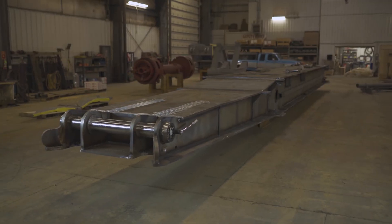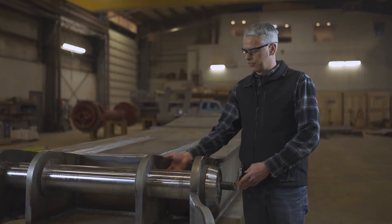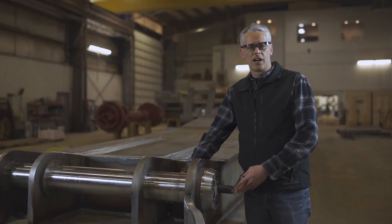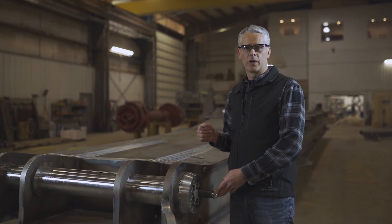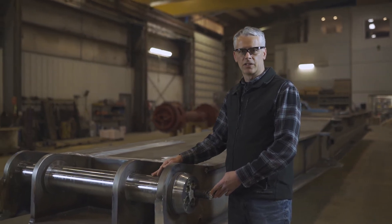When picking up the low boy or lowering it, the gooseneck half shells remain stationary on the pickup shaft. This greatly reduces the wear on the gooseneck half shells as well as the gooseneck hooks.